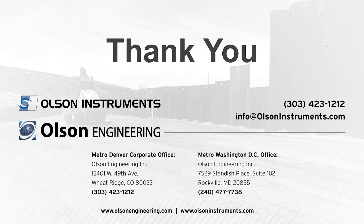Someone notes they tried this 20 years ago in Europe and it was still a chicken and egg problem. Well, they're ahead of us. You will see this come forward because of the changing design approach where modulus matters — that's probably the simplest way to put it. There's definite interest at all DOT levels. The University of Maryland follow-on study's conclusion was that it is definitely a very real replacement for doing nuclear density gauge testing alone.